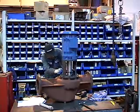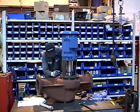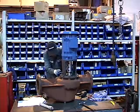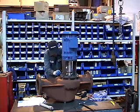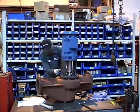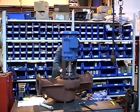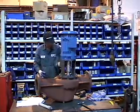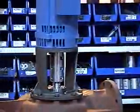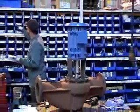Then he's going to bring down the rotated part of the seal and then tighten the set screw. After tightening the set screw, Nalich is going to remove the clip that's inside the rotated part of the seal. Then he's going to check to make sure it spins correctly. Now after doing that, Nalich is going to get all the parts for the flush line.